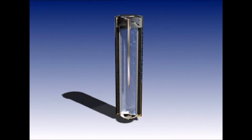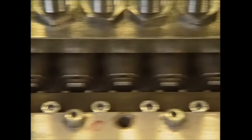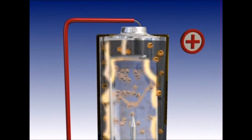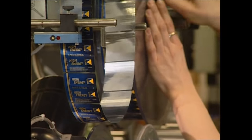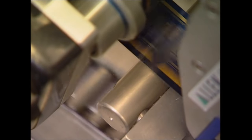Once they've been assembled, the plates and pins are fed into this machine and a hydraulic press squeezes them into the waiting case. They're now complete, although at this stage they don't look like the batteries you would recognize. Before they receive their trademark stickers, they're all tested. If the battery's lining is damaged, then it short-circuits and won't give out any power. This machine tests each one and removes any of the faulty ones so you're not left frustrated and powerless. Rolls of stickers are loaded up and attached to the batteries, and now they're complete. So next time you're crushed out on the couch with the remote control, spare a thought for the electrons that are saving you from getting up.